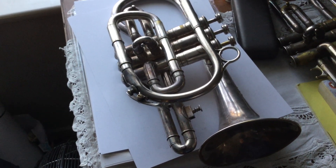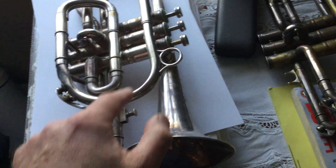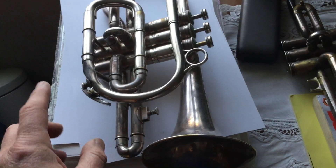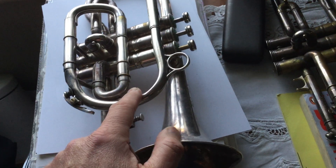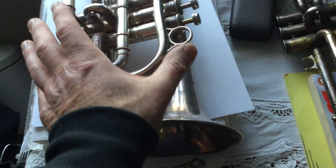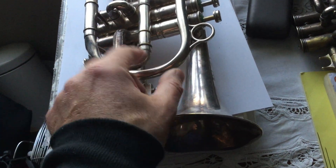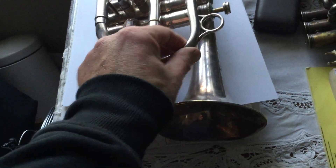It's the sort of thing most instrument repairers wouldn't even look at, because it involves so much heat — there are four points that have to be heated simultaneously, here and here and here and here. The whole lot can become unsweated from there, and then once that's detached, it can be straightened and worked out.